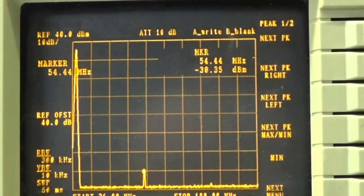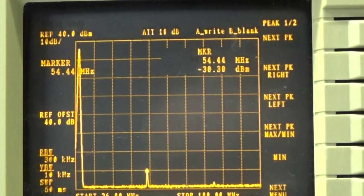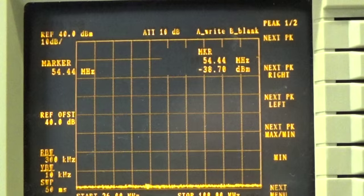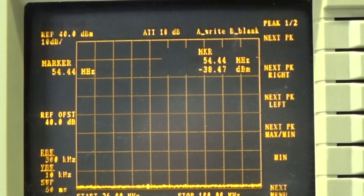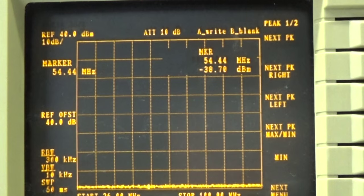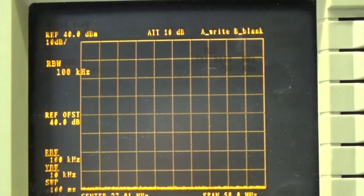And in this case, and of course with the Cobra, both radios are exceeding the level which is required to get at least the CE labeling. And so, therefore, this is a little bit funny, and I just want to talk to some manufacturers. I do not have an idea right now why these radios are not fulfilling the required values, so that's a little bit confusing to me. Okay, and then let's do our spurious test as well.